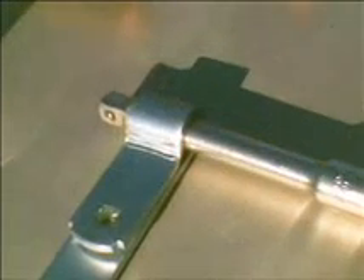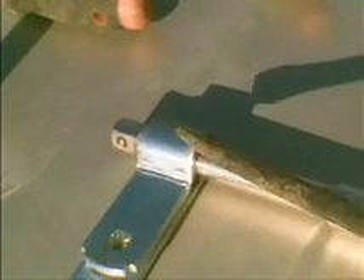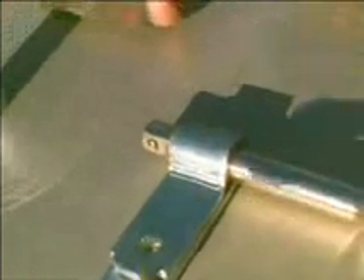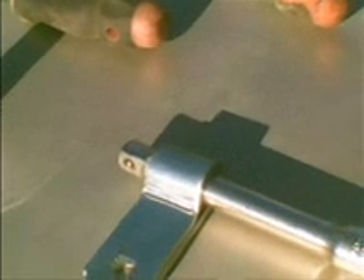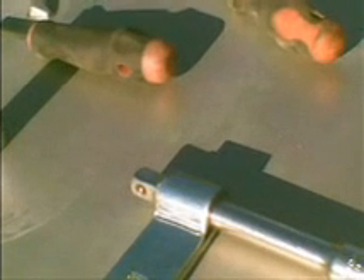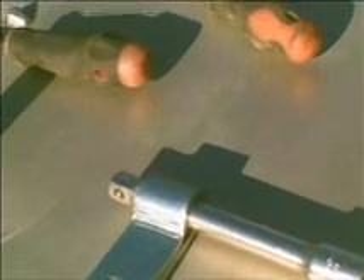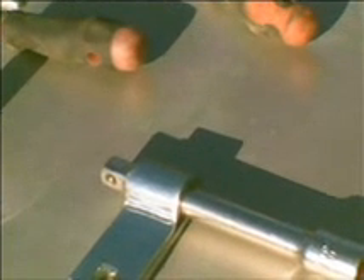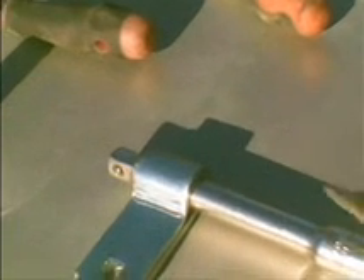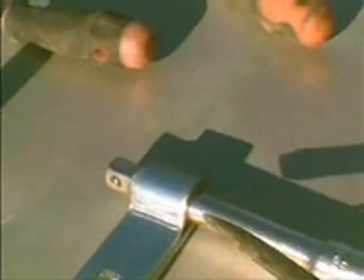What I did is I used a grinding stone chucked into a drill press and ground it out on the inside so the extension would slide through. You could also heat it to expand it, or if you don't have a drill press, use a circular file like a chainsaw file — though that could take a day or so. You want a good snug fit for the drive, not sloppy.